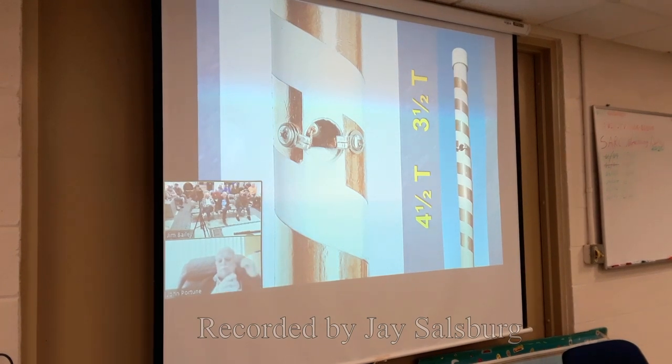And you'll end up with the dipole with the antenna on the right. Then you come down the pipe roughly 3.5 turns from the top, which is 4.5 turns from the bottom. We'll get to why it's different here in a minute. And you make a gap at that point: 3.5 turns on the top, 4.5 turns on the bottom. Then you drill a hole at that point.